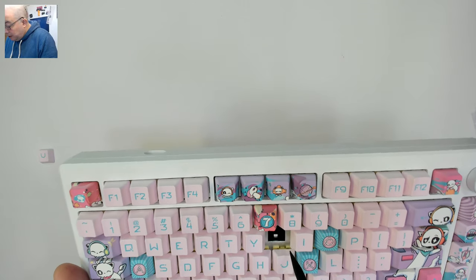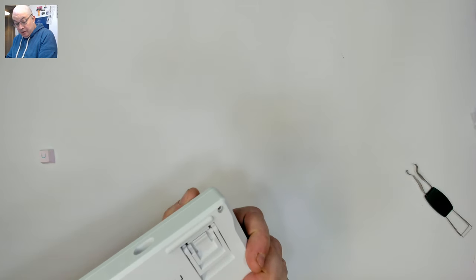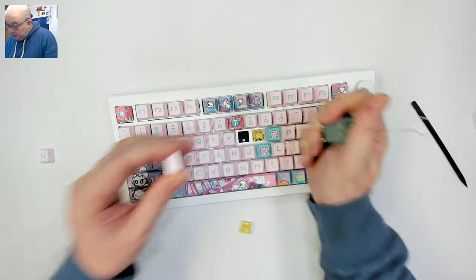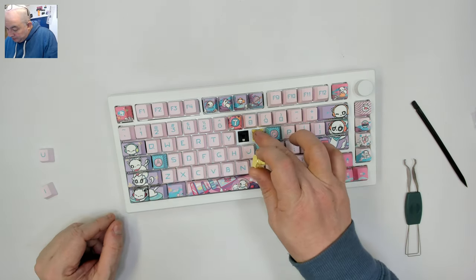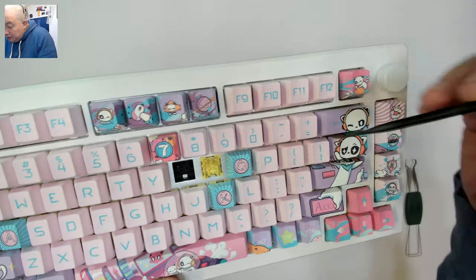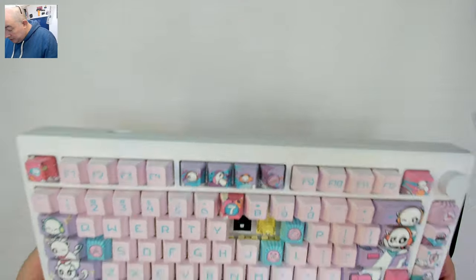There are actually Kailh hot swap sockets on this PCB. I mean, Kailh style, I don't know if they're the Kailh brand, but that's not something I was expecting to see on there. So that's definitely something to check out when I come back to this. But this, because there's definitely no pins on here, there's just a slider and a little magnet down at the bottom. But I am just kind of surprised to see actual pins, and it does not have the cutouts for the 5 pins. It just has the 3 regular pins. That's interesting. I gotta say, that's real interesting.